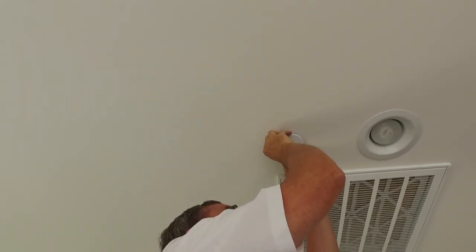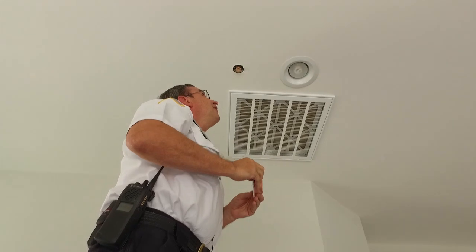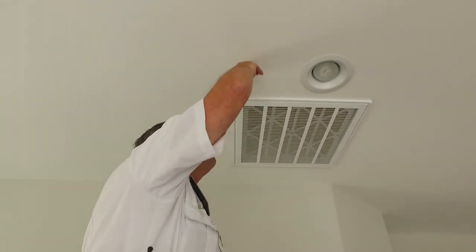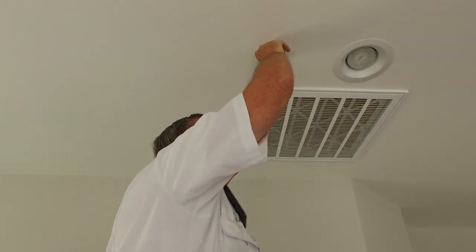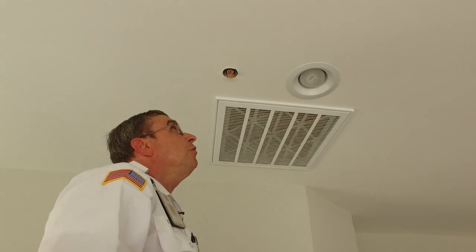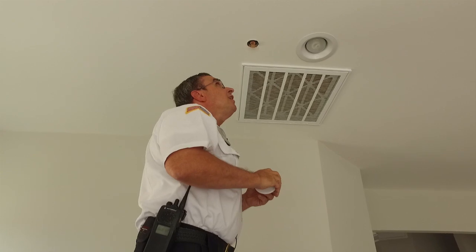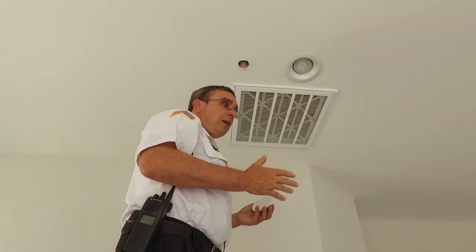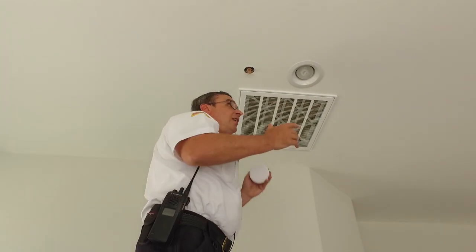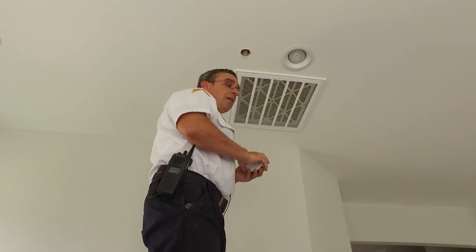While you're painting, you can just come up and take the caps off — that won't set off the sprinkler. Folks are a little scared about that, but you'll be fine. With the cap off, just check the sprinkler to make sure there's some play in it, that it moves up and down and isn't painted. During inspections we check the heads, but sometimes painters come in after and do final touch-ups and get some paint on them.